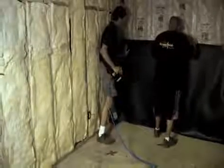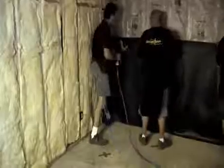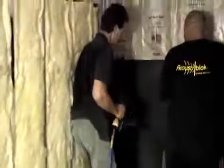When you do this, leave a little bit of play from the first stud to the next. Make sure that the top edge of your material is level and straight. This is very important. If you're off an inch here, you could be off 6 or 7 inches at the end of the run. Staple it in the same manner as the first piece.